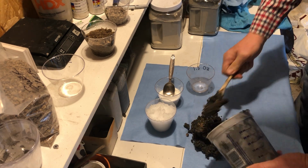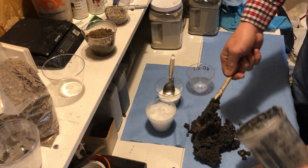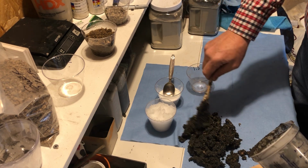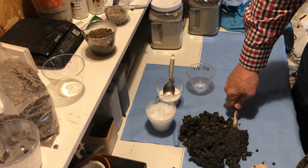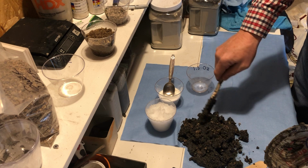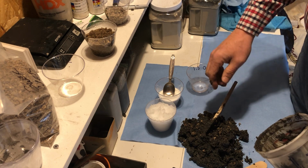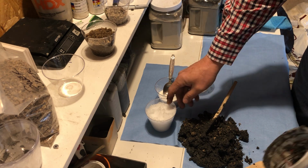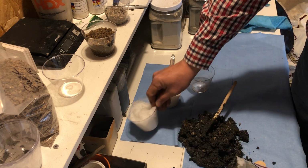In a few minutes. And again, this is using 7.5% by weight of power pellets to manage this sludge. It was 45% moisture. Easily loadable without squeezing any water out of it, and will pass paint filter test at a landfill, no problem. And again, we utilize ag fibers to act as a densifier rather than using a straight polymer. If you take this to a landfill, nobody's going to be very happy with you. And besides, it's going to be very expensive.